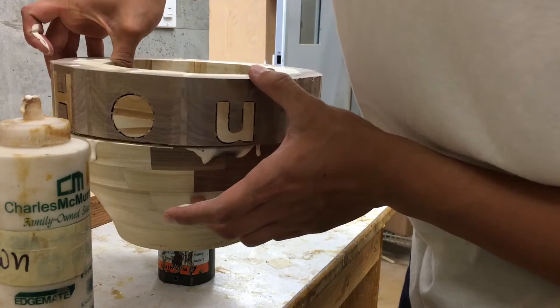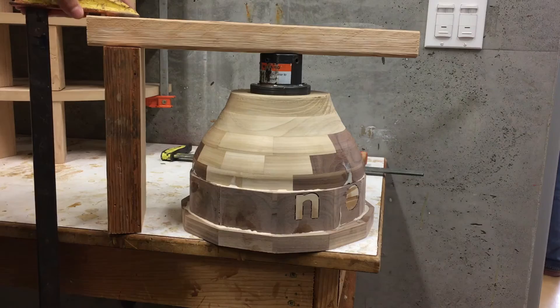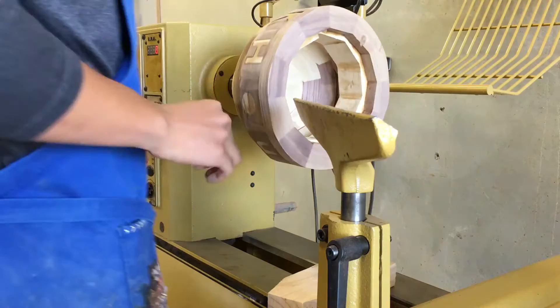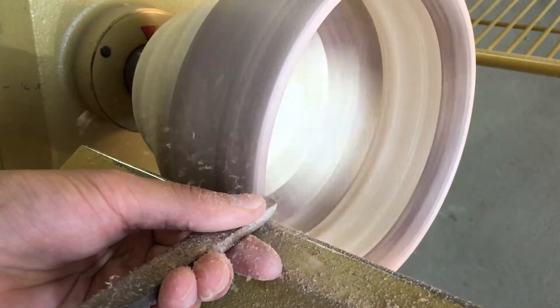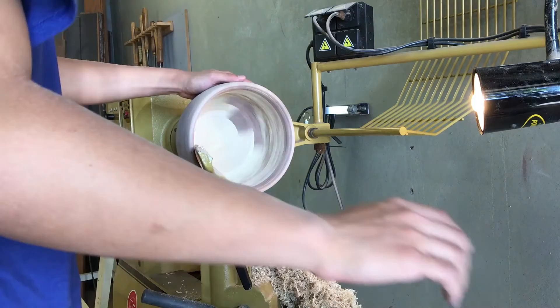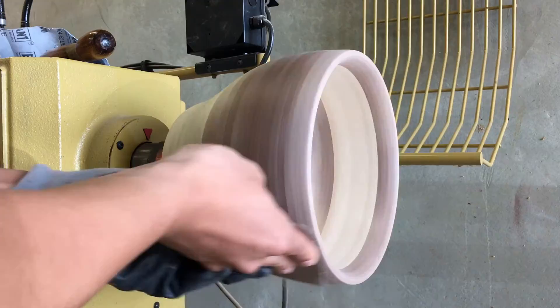I glue the remaining two rings onto the rings I've already turned. My favorite wood YouTuber, Frank Howarth, uses this method of having a piece of scrap wood on one side, then using a sort of lever mechanism to apply pressure downward. With the entire bowl now assembled, I can start turning the top half. After everything is relatively smooth, I can add wood filler into the cracks in the letters. The CNC left small gaps, so I mixed some of my old sawdust and glue and pressed it into the cracks. I sand the excess wood filler off.